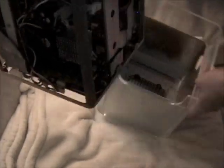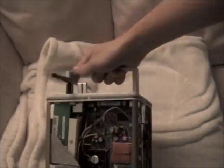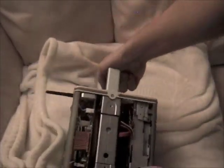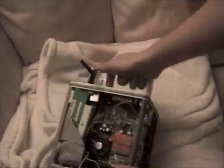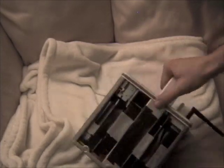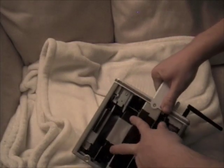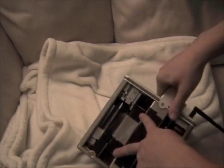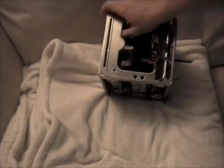One of the neatest features of this computer is that it has this slide-out chassis. As you can see, the motherboard fits just barely in there — I actually had to gouge out some of the edges so that it would all fit. The Wi-Fi card fits in there, attached with a flexible PCI extender — that's a ribbon cable. I swapped out the hard drive with a serial ATA terabyte-sized drive.